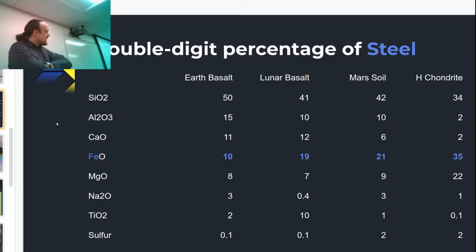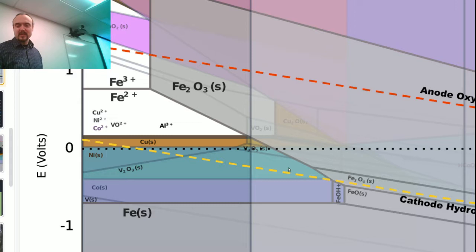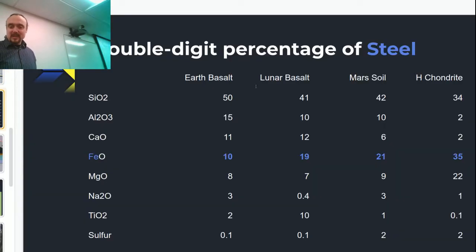The reason to focus on steel is mostly because of the Pourbaix diagram — I know I can electrodeposit steel. It's at least theoretically plausible, though it's a little hard to do. Actually, the higher the pH gets, the better it is — the closer the two lines get together. Ideally you'd be doing this at pH three or four, but it gets hard to keep anything in solution at that point — it wants to plate as magnetite. So essentially, steel is plausible.